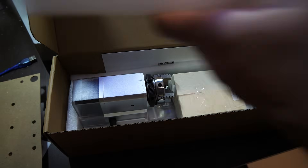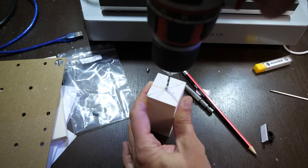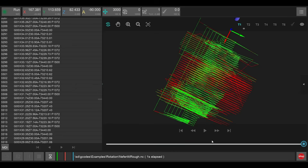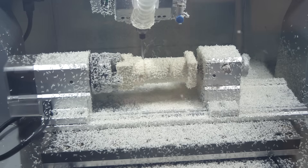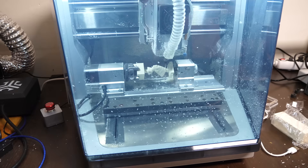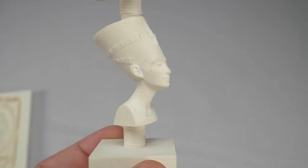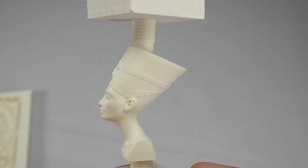Next test: the 4th axis. I won't show the full installation — it was straightforward following the guide. We use similar material, load the file, adjust the parameters — 2 files this time, starting with the roughing pass. I can see where the actual work will happen, and after probing it is time to go. After roughing, tons of clean up, then refinement. The final result looks very impressive with lots of fine detail. The ends still need trimming but I did not expect this level of resolution.